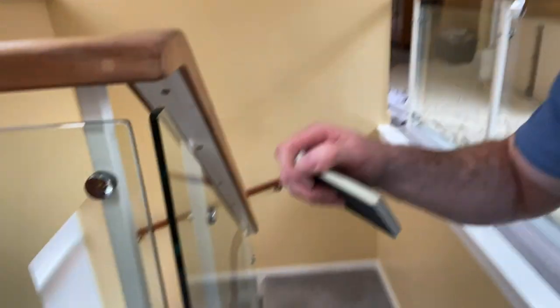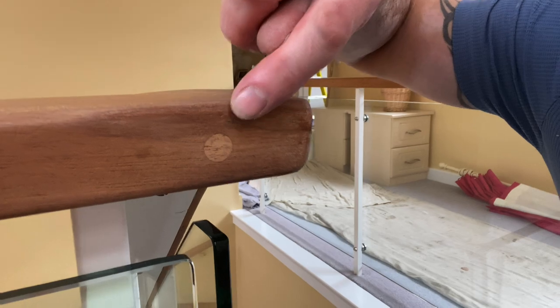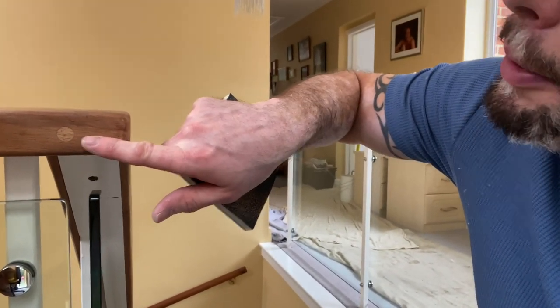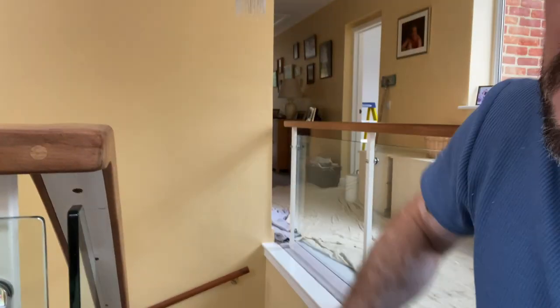It doesn't take long. I'll give it a fine little look over - I'm gonna go get a bit more wax, there's a tiny little joint I don't know if you can see it, just there, so I'll fill that a little bit. But apart from that, that is how you do it, simple as that. And then when I've rubbed it, if it looks a bit duller because I've been scratching it up a little bit, I'll just get a very light piece of varnish and just lick that one piece over. Done and dusted. And that's how you repair a bit of wooden damage to woodwork.